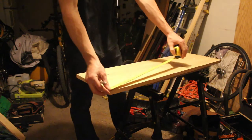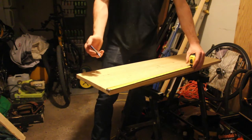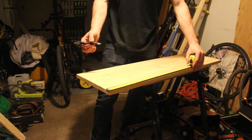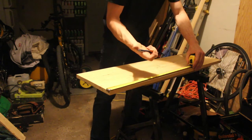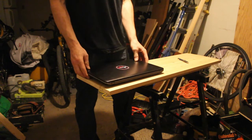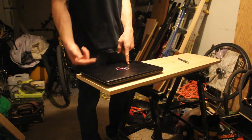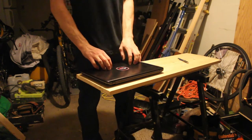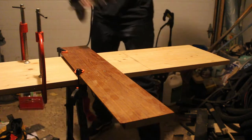For starters, let's measure out the tabletop — well, not the tabletop, but the additional height added to the table. What we're putting under here is a laptop and a mouse. We'll go for 16 inches — but if I'm flush with that, there's absolutely no room. The laptop I'm making this for is smaller, but a 17-inch is a better guideline in case they upgrade. Either way, we'll go with 20 inches instead of 16, because the extra 4 inches gives lots of clearance. Now that it's all measured out, let's cut.